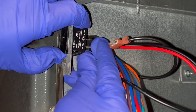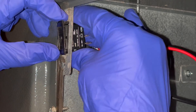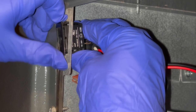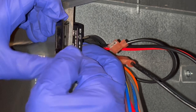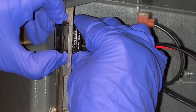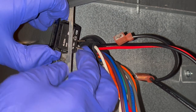While I struggled to get the switch out, let me explain the purpose of the door switch on the furnace. This is a safety feature in that when the panel is screwed on, it presses on the door switch and keeps the furnace in the on state. When anyone takes the panel off, the door switch gets unpressed and the furnace is turned off, to prevent the gas furnace blower from circulating carbon monoxide in case the blower panel is off.